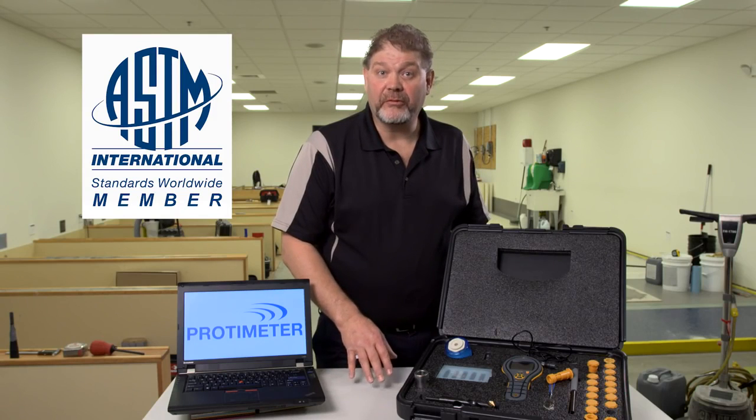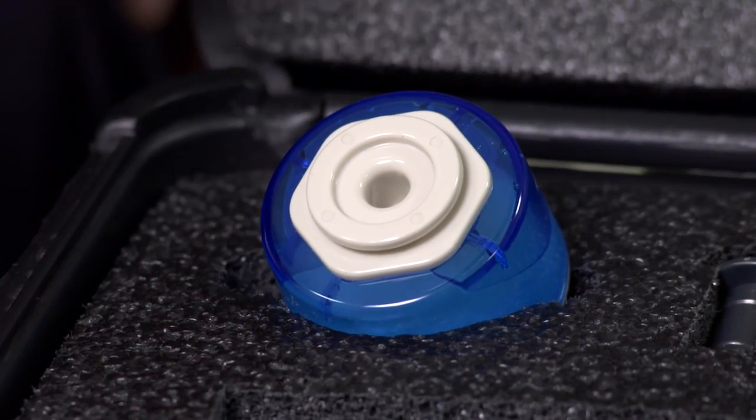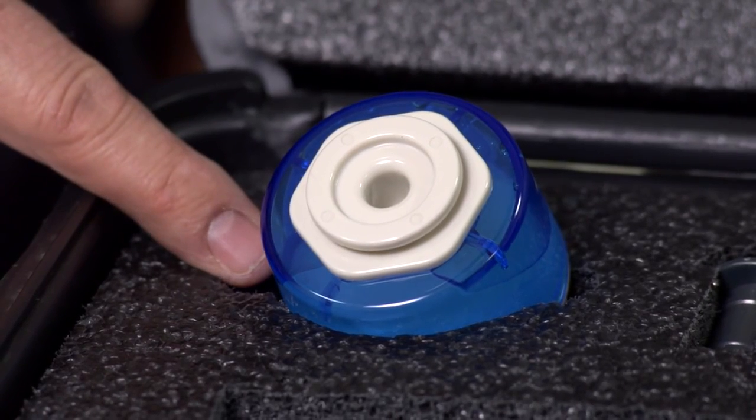Today we'll be outlining methods and demonstrating the F2170-11 standard. This standard is a North American standard, but it is being widely adopted globally. Please check your national standard before using this kit. The ASTM standard requires that you check the probes within 30 days of use; however, we recommend you check that before every job. Included with the kit is a salt solution calibration check that checks each probe at 75% relative humidity.